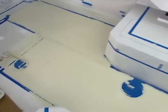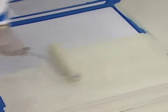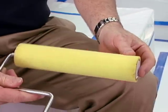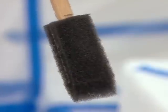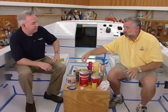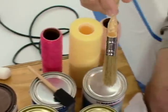Talk to me about the foam roller that we're using, how thick is this roller, and why are we using this particular one? There's the right tool for the right job. Here we have a yellow foam roller — it's a marine-grade roller, it's one-eighth of an inch thick, and it holds up to the solvents in the paints that are available today, so the roller won't fall apart. It comes in about a seven-inch; this happens to be a nine-inch roller. There are three-inch rollers as well. Don't use a roller with the same material as this little foam brush — it will disintegrate in solvents over time and get in your paint job. You also don't want to brush it, because you're going to be dragging the non-skid and you're going to see channels and grooves.